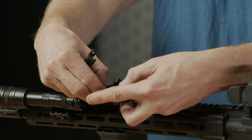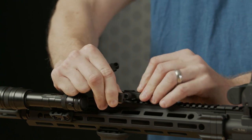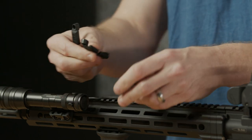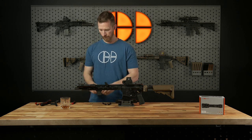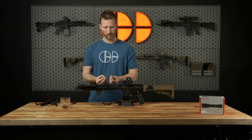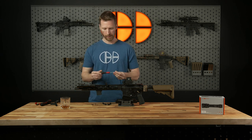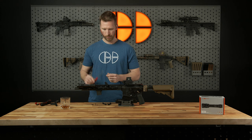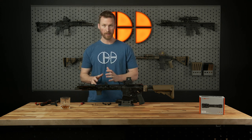That channel fits very precisely to the cable, allowing you to house it, protect it, and basically enclose it and keep it away from the elements. Then you've got two hex head screws and the two nuts associated with them. Those are the parts, and you need a 7/64ths driver to actually tighten everything down. The install is actually pretty simple in that regard — there's not a lot of pieces.